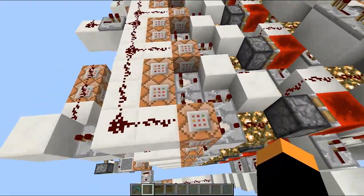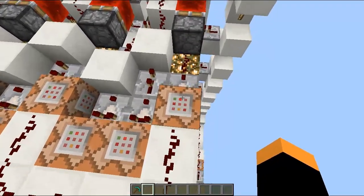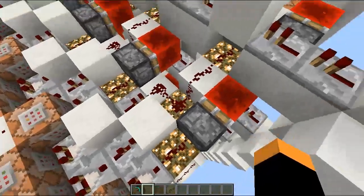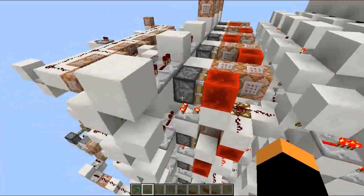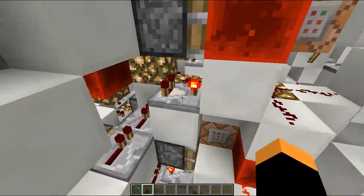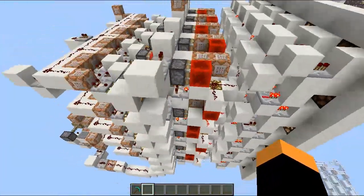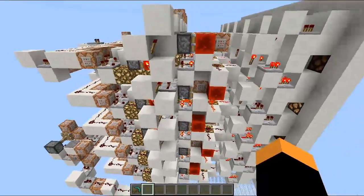This one here is the control system. This one is the one that gets set when the cursor is on it. This one is for the set command, and this one is for the RAM. Like you can see, those are running into the same one and controlling the pixel set. The cursor just goes down here into this comparator, which starts a little clock to have this blinking effect of the cursor. And that is basically the whole mechanics behind here.